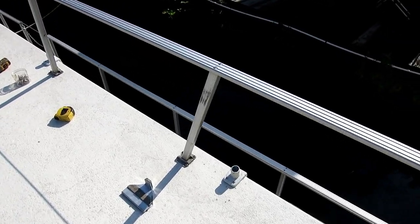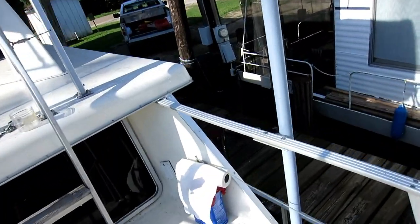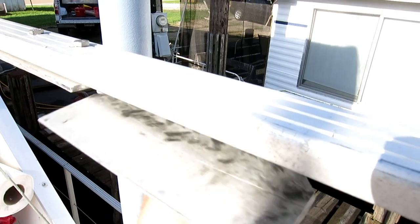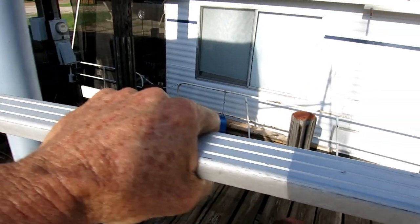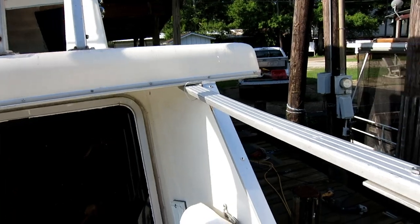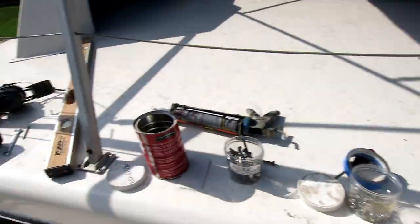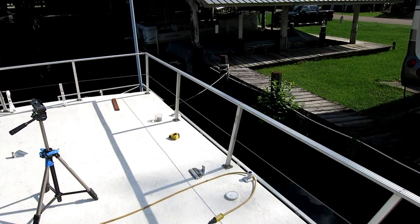It's a new day. I've got the last two feet installed and the one I welded yesterday seems to be fine, except it's no longer painted. I've also cut and fit the first two brackets to connect the post to the handrail — all I had to do was rip it down a little because it was a little too wide. Side to side this won't gain us a lot because the handrail isn't the strongest side to side, but front to back this handrail is fastened securely. By the time I get all three attached to the handrail with the same bracket, that's going to be big in the strength department. Now I have my string pulled front to back so I can get the length of these two remaining columns.